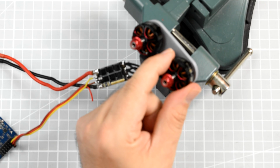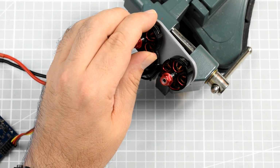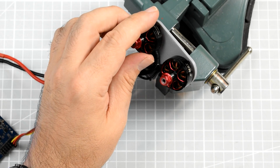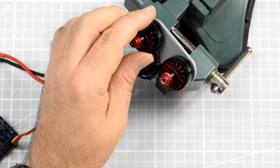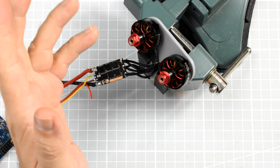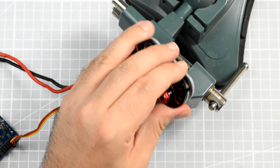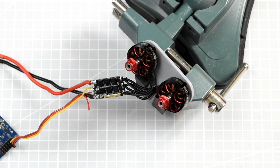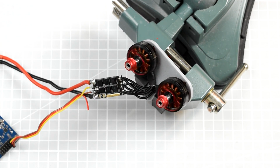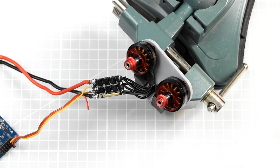Oh, so okay, interesting. So it even has a problem to start when one of the motors is broken, and let's see if it will start if one just has extra torque. Apparently, if the back EMF detection starts to work, okay, and now they don't want to start again, but apparently if the back EMF detection starts, manual start. Oh yeah, manual start seems to help. So one more time. Not okay. So if they start, they work, but if they do not start, they just do not start.